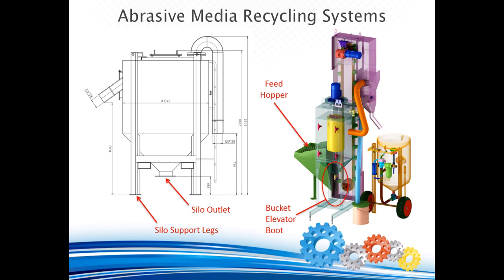It is important to note that the vacuum recovery rate is not the same as the silo output feed rate. The latter is governed by the orifice size of the silo outlet itself, or the orifice of the valve or piping attached to the silo outlet.